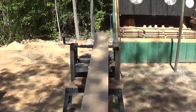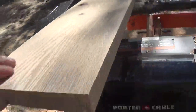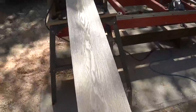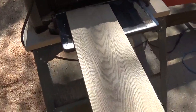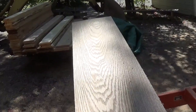The board has gone through the planer a second time on this face. I'm looking at it and feeling it to find out if it's been planed all the way down. It has been planed except for this very edge right here. Since I have more than an inch of wood left, I can run it through again — I want the board to be as flat as possible. You'll notice there's no snipe here, just because this board is fairly flat and going through the planer nicely.